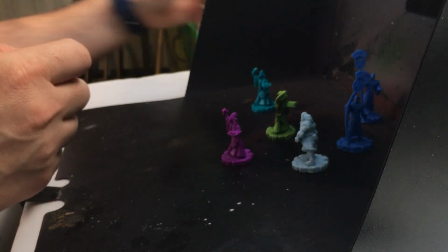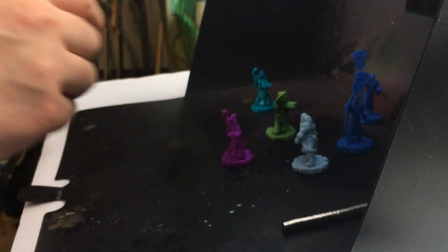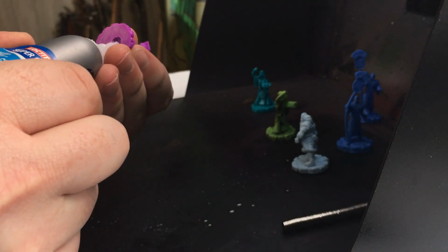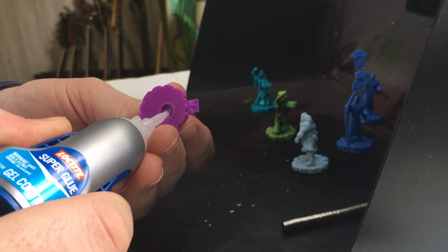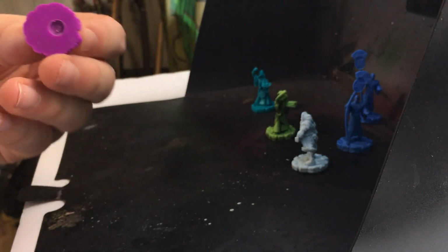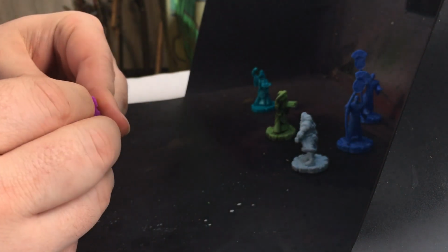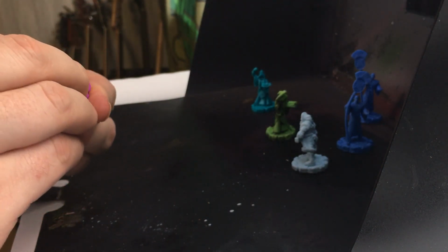And so let's just slap a couple of these in here. The magnets are really strong, and magnet to magnet is stronger than magnet to steel. And so what I've been doing is just a drop of Loctite gel in the rounded part of the hole that we drilled, because we had a round tip drill bit. So we've got a dab of glue in there, and then I'm just gonna take less magnets than this because it'll never come off that way. So I've just been taking a few magnets, slide it in there, and then peel it off even. Been working pretty good.